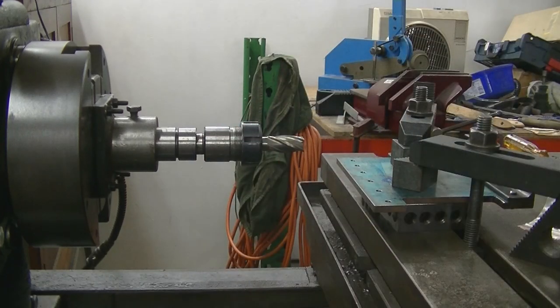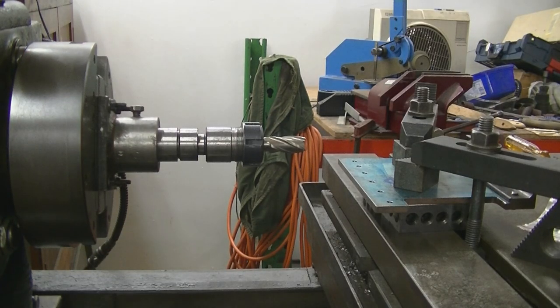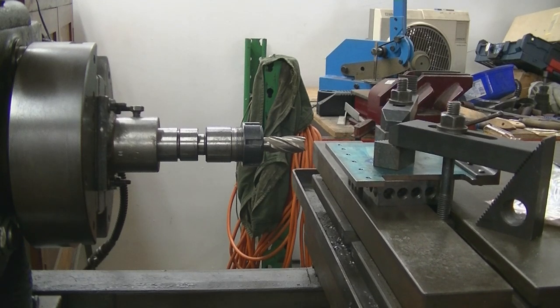I've stuck to the one style of chuck across all the machines where possible. One size of collet, so they're all interchangeable. Same collet goes in the work head for the tool and cutter grinders. It just makes life easy. That's a 20mm PNN cobalt end mill. I think it'll stand up to 240 RPM, and I'm only going to be taking about 4 or 5 thou cut at a time, so I can measure and make sure I'm not making more mistakes.